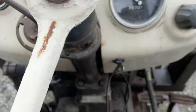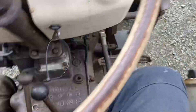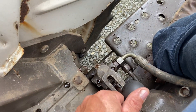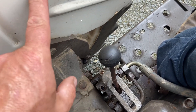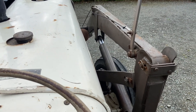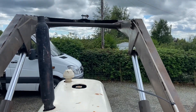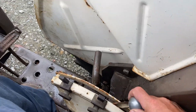There's hand revs there and foot revs down here. I'm not going to explain the gearbox — that's pretty straightforward. This one here is your hydraulic selector. There are four settings on it; we're concerned with two of them. The first one, all the way towards that side of the tractor, allows us to work the front loader. All the way over there, then use this radius arm.